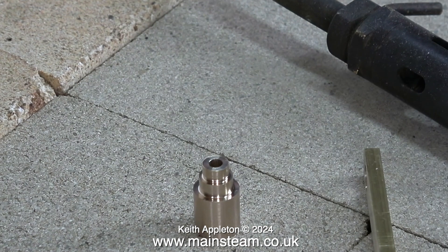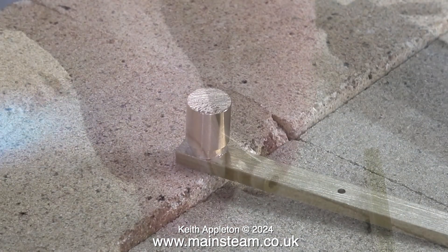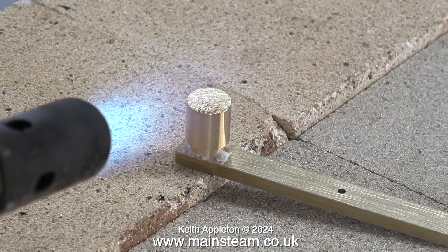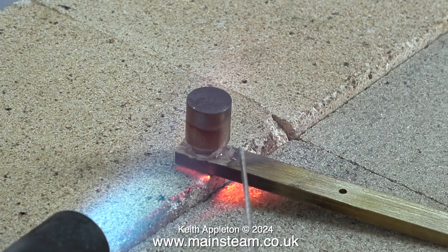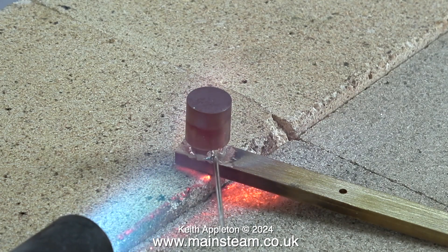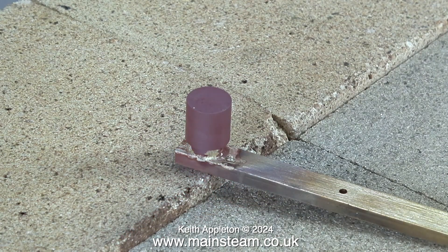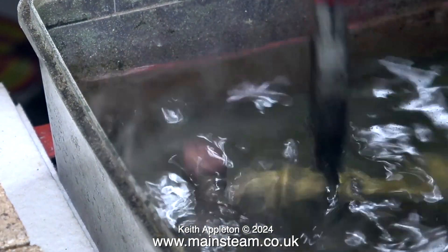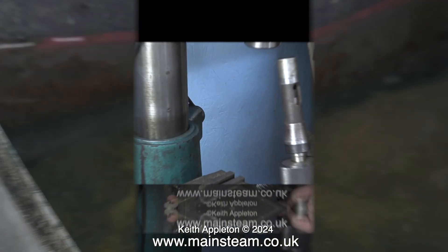Now I'm going to try out my new brazing hearth in the outer part of the workshop. First I spread the easy-flow number two silver solder flux onto the part, then using my blowtorch I heat the part up until it glows red. Watch the flux as a good guide — when silver soldering, when the flux takes on a watery appearance, that's the time to just touch the silver solder stick on the joint. The silver solder flashes all the way around the joint. After it flashes, hold the heat on for a very short time, then let it cool to black, and quench it in a pot of ordinary water.